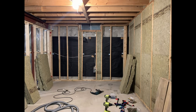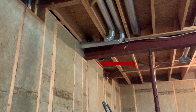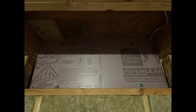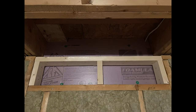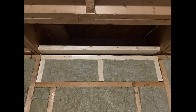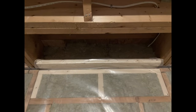Another challenge was a small window at the front of the room — a typical small basement window from the 90s, too small for someone to climb out of. This window goes up into the joist area and would have made it impossible to prevent sound from traveling through from the family room above, and it would also let a lot of sound pass between the outside and the studio. I decided early on to remove it completely, but was running out of time before the weather got colder, so I've done just the first half by covering and sealing it off before drywall went up. The window looks out under a deck I'll replace in a year or two, so I'll remove it from the outside then. For now I've sealed off the window with rigid insulation, some acoustic seal, then framed in the area to complete the wall assembly.